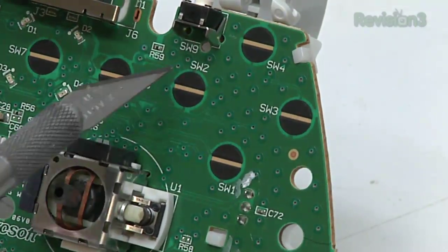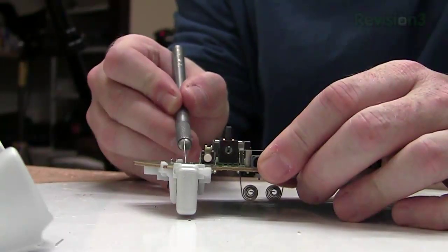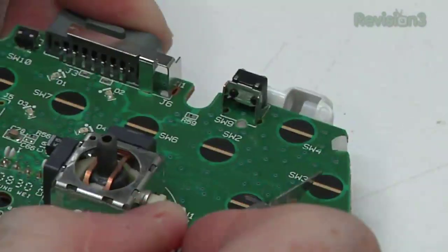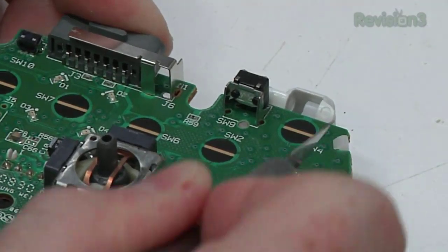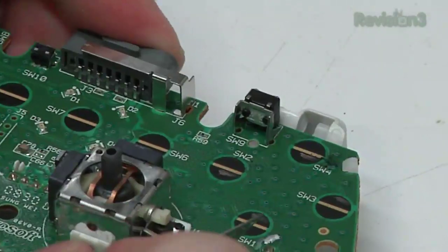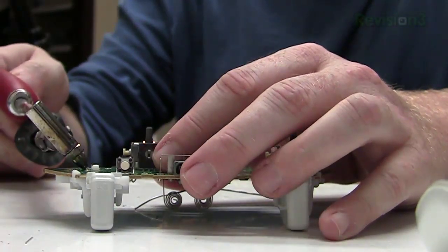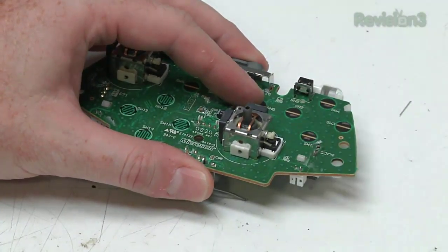On all modern Xbox controllers, there's a signal line and a ground for each one of the buttons. We're going to use an X-Acto knife and go side by side here, using the flat of the blade to reveal copper. You basically just need enough to solder to. Then we can scratch off one of the bottom pads so we have a ground connection. We add a little bit of solder to the points we want to disconnect, which helps the solder reflow, and then we can remove it with the desoldering iron.